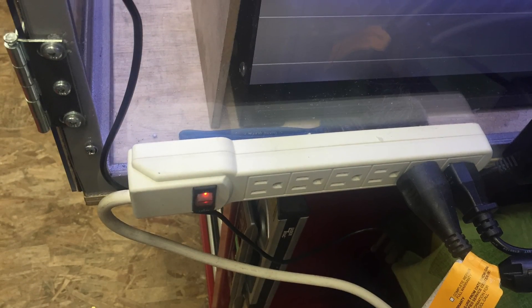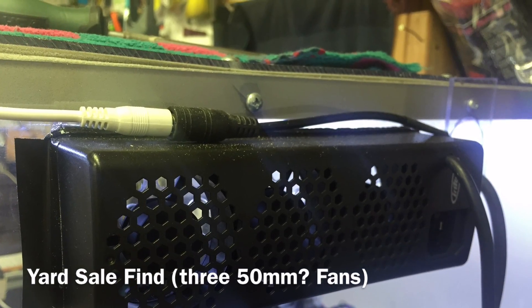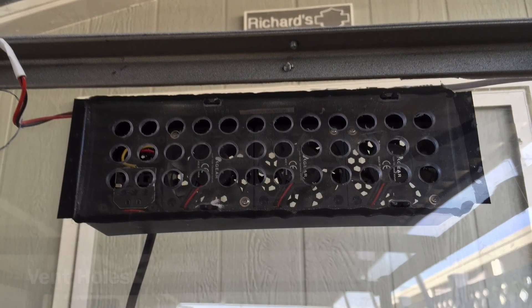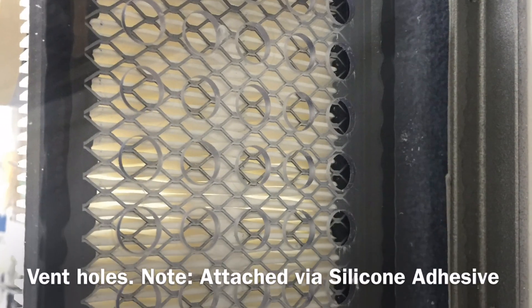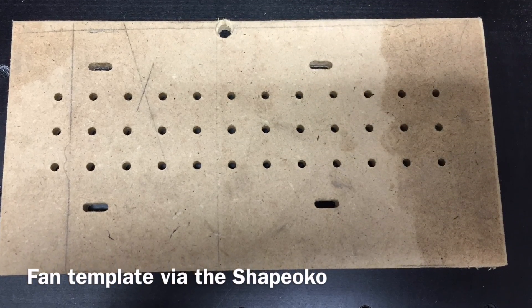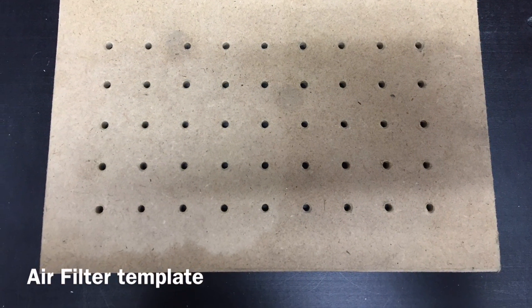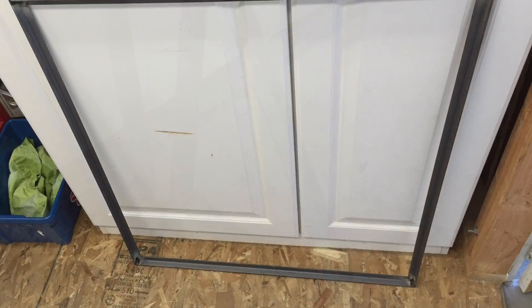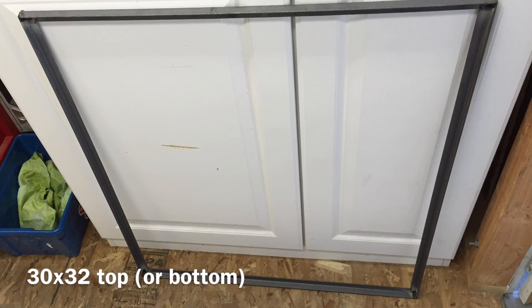These following slides are, for the most part, self-explanatory. So sit back, relax, and take some notes. I've designed this enclosure for many owners — simple to make, fairly inexpensive to make. My enclosure uses Lexan rather than acrylic plexiglass. The safety of Lexan is well-known in industry for stopping a projectile. And if you use your machine to cut metal, at some point in time you will break a cutter.